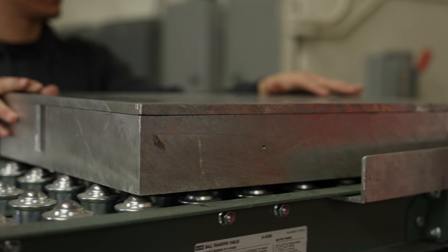So what makes armor? Heat and pressure. Why would you give that responsibility to anybody else? We maintain the heat and the pressure and the consistency of that heat and pressure through every lot of our manufacturing by laying up the raw material inside of our own tooling and putting it into our own hydraulic press. Doing it any other way is not going to give you the consistency that you need to guarantee that body armor is going to stop the threat.